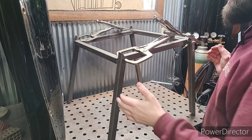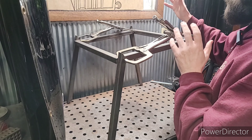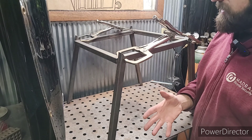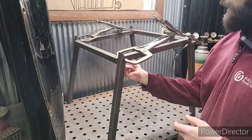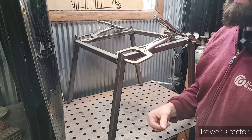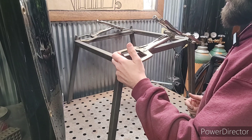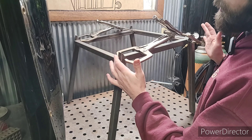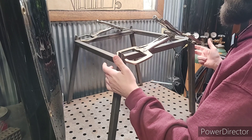Here's where we're at on the chair. These are pieces of drop from the same frames that don't fit, so I just broke them apart and clamped them on to the seat. The front of the seat is here and you can see it's pitched back. You can write this on scale paper to figure out your dimensions and angles, or just scribe a line on the back on both sides — that is your angle for cutting. We'll transfer that angle up as high as we can, cut those angles, weld the frame, and tack these on.